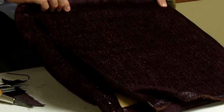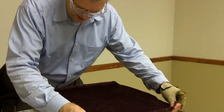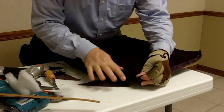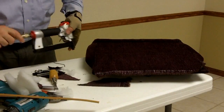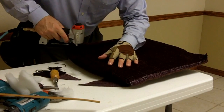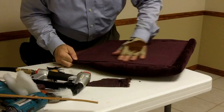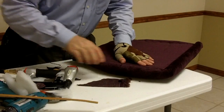When you pull the outside back fabric down, see how nicely it meets the inside back. This comes straight down — staple at the top, pull it straight down, staple at the bottom, fill in the blank. Those staples are all going to be covered. You can color the staples with a marker — if we have enough manpower and the right color markers, we may go ahead and color the staples used on the outside back so they won't flash bright silver if they do show.